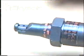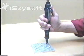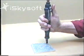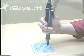Place an insert in the chamber. Position the end of the tool over the hole. Press the forward lever. The mandrel rotates, drives forward, picking up the helicoil on its way through the pre-winder. Reaching the correct depth, it will stop. Hold down the lever. Press the button. The mandrel reverses, leaving the insert in the hole. When the mandrel stops in the back position, both lever and button are released.